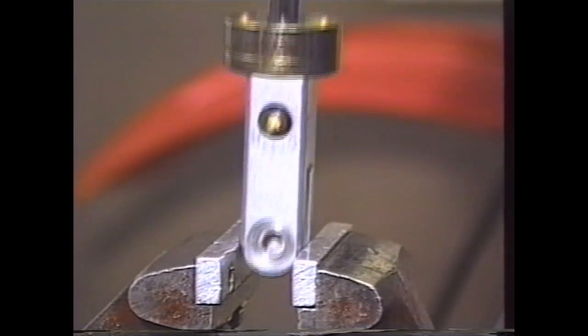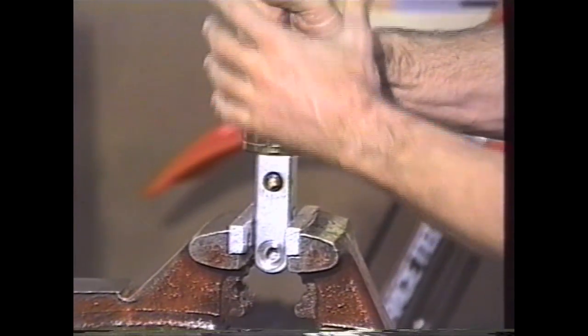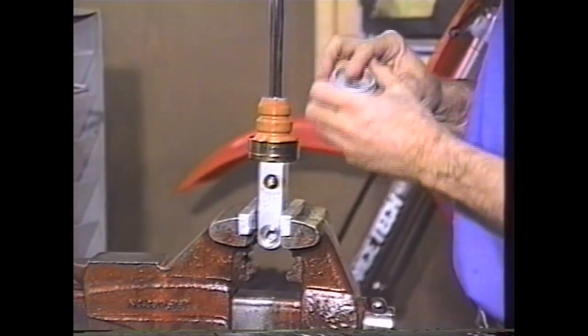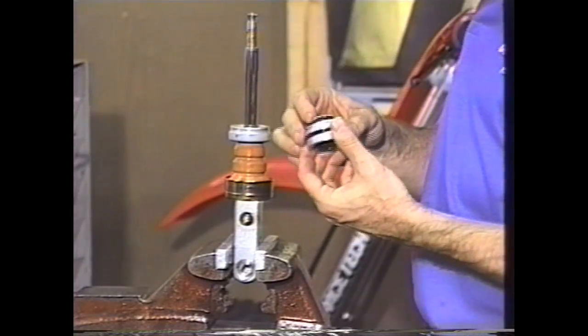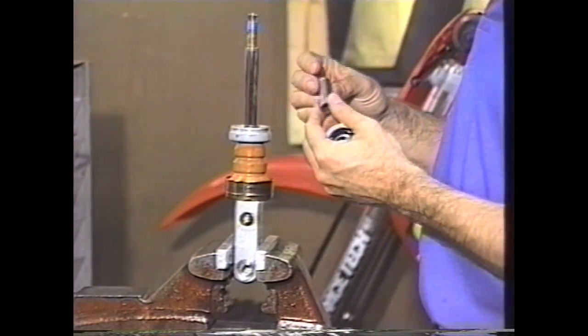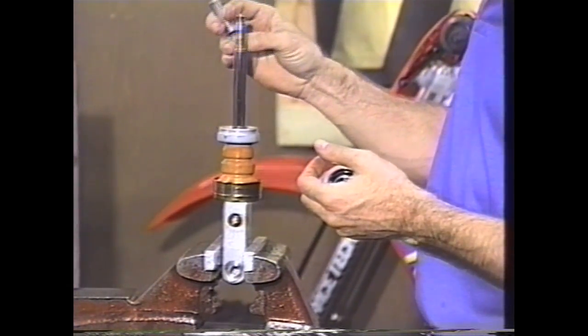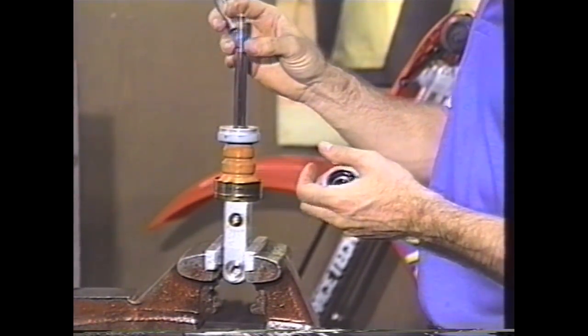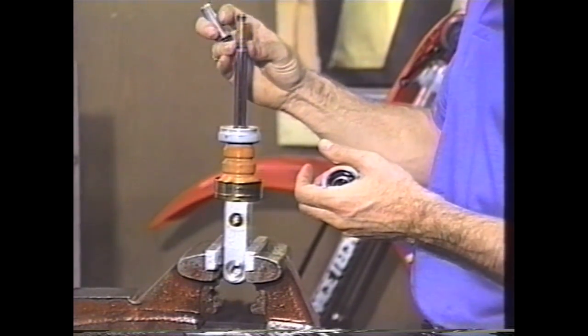Once you've inspected and cleaned everything, including the inside of the shaft, you're going to go ahead and reassemble the shaft with the plate there. You've got your clean new seal head assembly. And we have another tool — this is something that we call a bullet tool, which isn't essential on the 16mm shafts, but it aids in assembly here. What you want to do is check and see that you don't have any burrs right on this edge here.